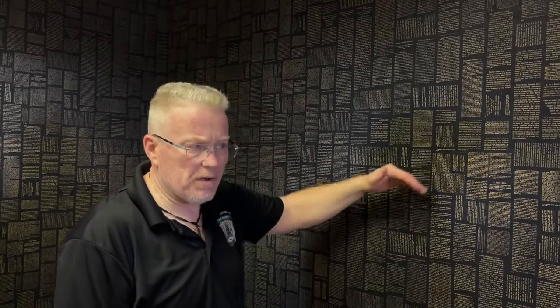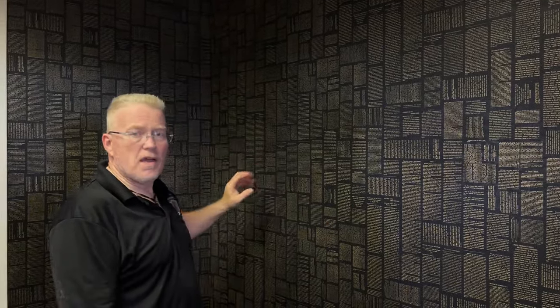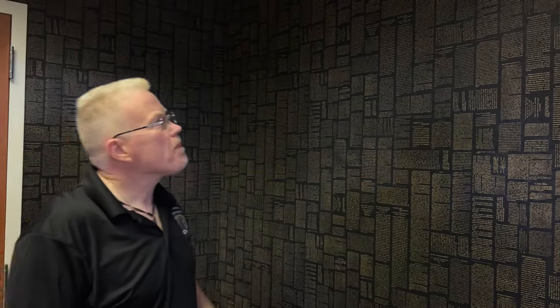If you have a laser level or a snap line or whatever, you can simply go at the lower part, in the middle, and at the top to make sure that your horizontal repeat, that is the image here and the image here, are all perfectly level. Okay? And so now we will do the double cut.